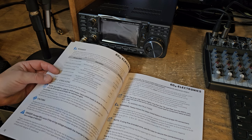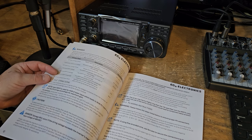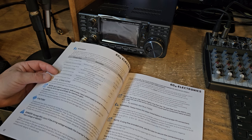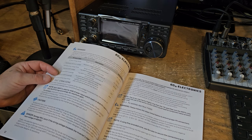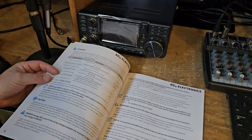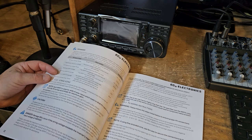Basically, I'm somewhere near that right now on my strings, but I'm also at 24 volts. So if I went to 40 volts or 48 volts, all my stuff would be in half. But my voltage is too low. So bare minimum for me, I need to go at least 3 panels in series before I can do anything. And then paralleling 3 panels is a pain in the butt, so you have multiples of 6 and 12, et cetera.